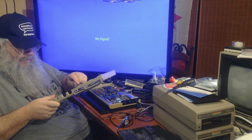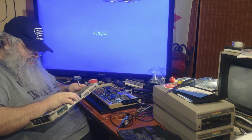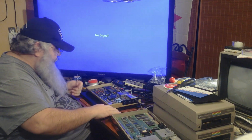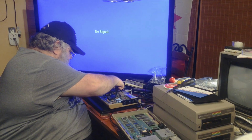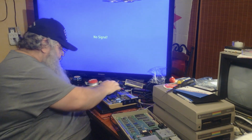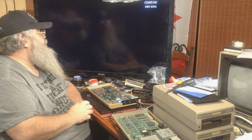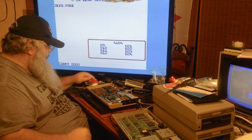Interesting. Indeed. I think I'm going to go for, I don't know why, one of the reasons I'll go for this is it's in a socket. It's tough. But I'm going to try the 6510, because who knows. So I'm going to leave the SID chip that just worked, that I know works, in this machine. Hello, take a 6510. Look at the pins. Establish the witness mark. Very carefully. Insert, and we're in. Soon it will come up. That was easy.